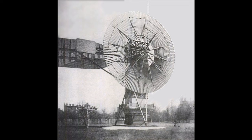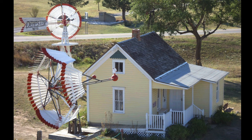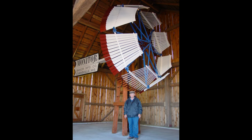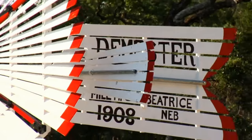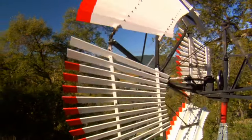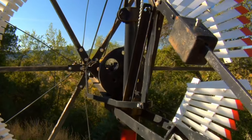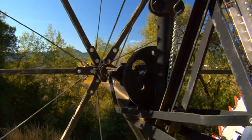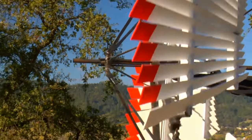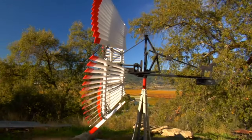Let's go to water-pumping windmills made by manufacturers and sold throughout the United States. The best way to describe the two different kinds are as a solid wheel or a sectional wheel. A sectional wheel folds over — each section of the wind wheel has a hinge piece. A solid wheel is just that, much like the windmill we make today. A sectional windmill is more complicated, but centrifugal force causes the wind wheel to roll each section over, slowing itself down. Then a series of levers and usually a counterbalance weight engages the wind wheel to fold flat and start spinning again, until another gust causes it to fold over individual sections again.